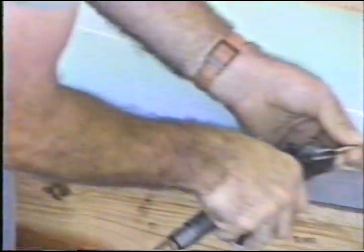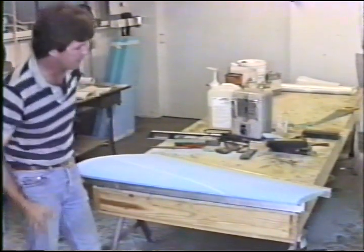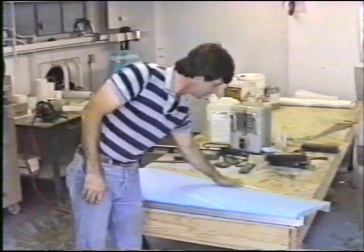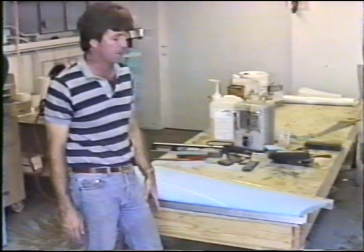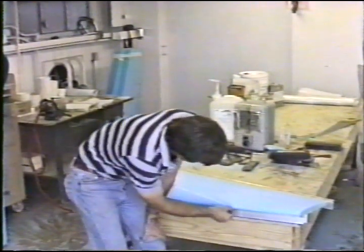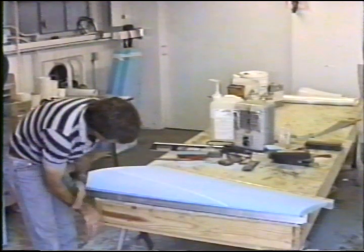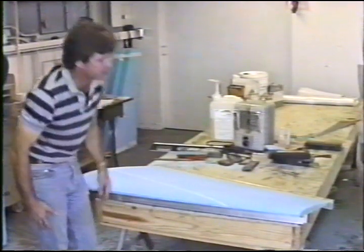Actually, this is done pretty simply. If you keep track of your cure, when the resin has reached the B stage, it's still relatively soft, but will not suck air if you open the bag. You can debag your vacuum bag and then use a razor blade to cut down the center line of your leading edge and remove the tape, thus avoiding the melting of the foam in this area. We're going to backfill that with dry micro just as we begin the laminate process, and it will receive glass micro slurry, and the whole works as one wet layer.